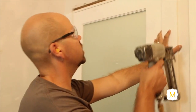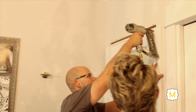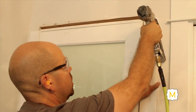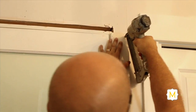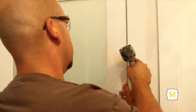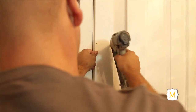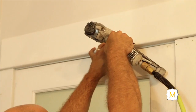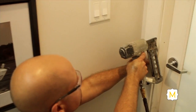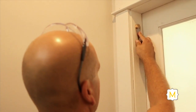On the other side, take your nail gun, depress it, shooting the casing into the meat of the door jamb. There are usually 2x4 studs behind, so the nail will bite into them. Slowly work your way down, nailing every foot to a foot and a half, shooting into the door jamb and into the wall. With both legs of the casing in place, take your architrave from before, place it on top, fasten it, and one side of the door is done. Then work on the other side. Fill any nail holes or screw holes and prep the frame ready for paint.